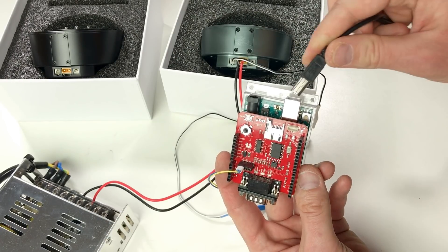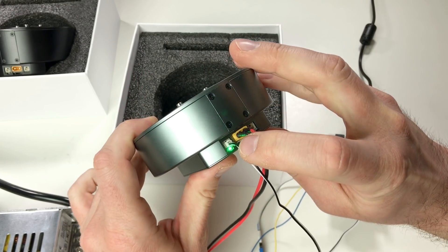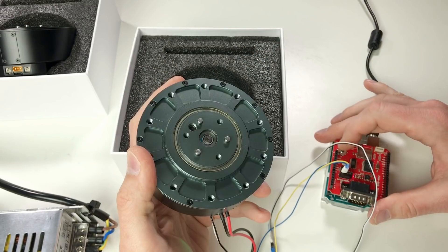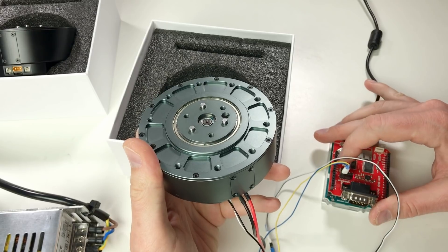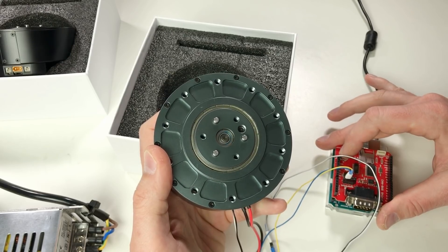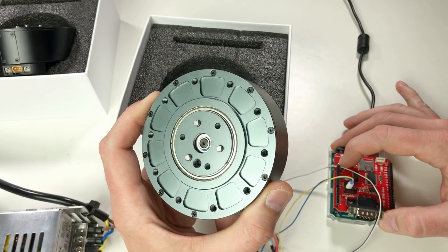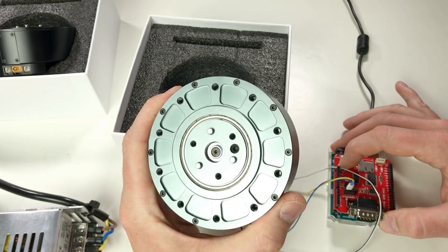The Arduino we're going to power through USB. The power supply is switched on and immediately we see the LED light up green. Arduino is also on, so everything is ready for the test. It works! Of course this is not maximum speed — I set a low speed for the test. As you can see it has multi-turn support in position control, so you can add an additional reduction stage and have a decent range of motion.